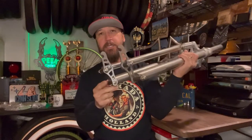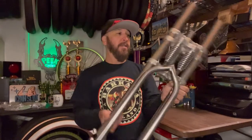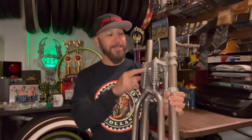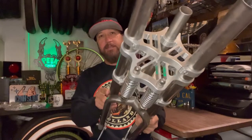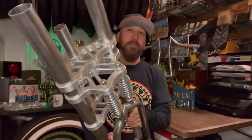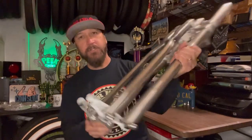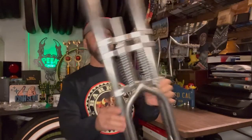It is not 100% the way it's going to be — I'm still working on a few tweaks. I'm pretty sure I'm going to change up the bottom here. These tubes that hold the hardware are very commonly done in the bicycle world, but I'm pretty sure I'm going to change it to plate, much like motorcycle springers. I'm still working on the spring source and the spring design. Otherwise the plates are the same as my triple trees, and that springer plate is set in stone. We also have custom-cut rockers to match the trees, cut by my good friend John at Gearhead Customs.